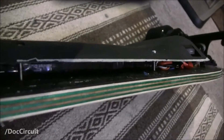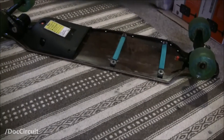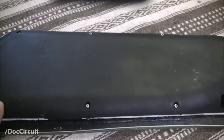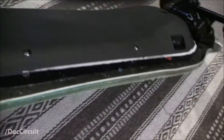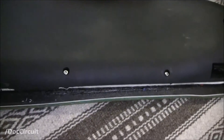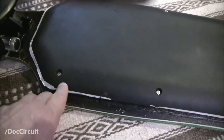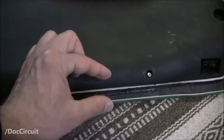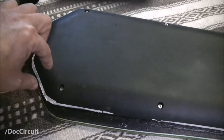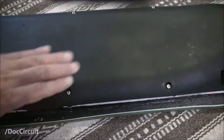The other thing to note is that gap — it's large, you can't ignore that. If I were to pursue this and try to permanently fasten two batteries under the case, I'd probably use some neoprene tape — some single-sided stuff, very thick, or two layers doubled up — all the way along the edge. I'd probably draw around the edge of the case with a felt tip pen, remove it, place some thick neoprene tape along the whole edge of the casing, and then when you fasten the casing in place via the long screws you clamp everything together.